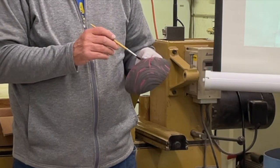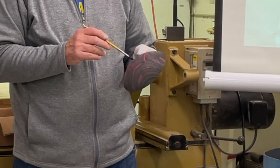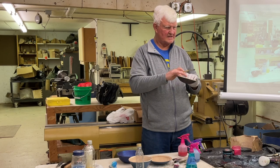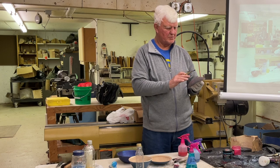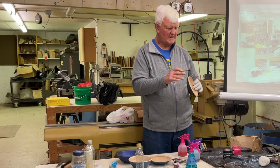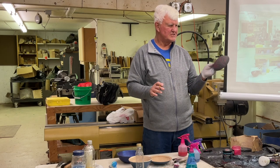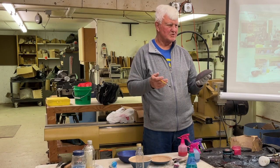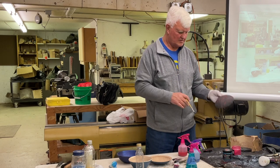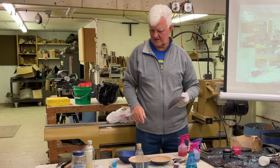So when I did this bowl originally yesterday, I only sanded to 120 on the inside and outside. When I came back today, I sanded the inside out — what I did was burn it. If something got on my fingers, I burned it, then took clear lacquer and sprayed it — that sealed the finish, because the carbon will be all over your fingers. Then I sanded the inside all the way to 600. My rattle can lacquer — there's the rattle can. We have a stash over there.